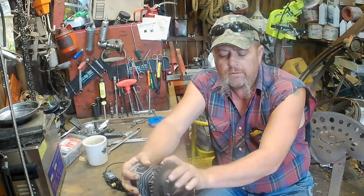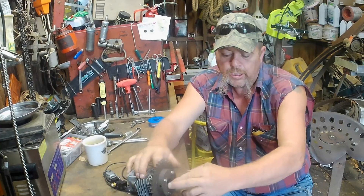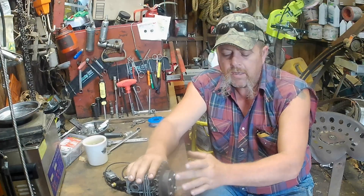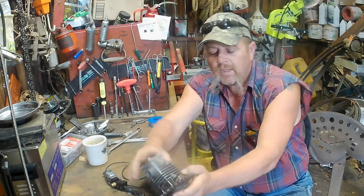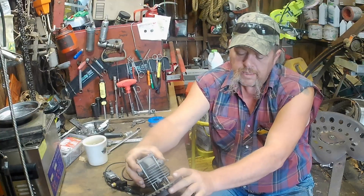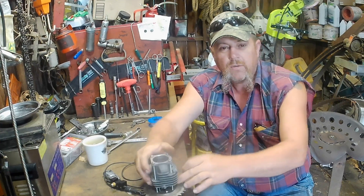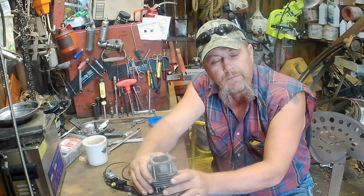It's a fixed bore cylinder - this is just a finished bore cylinder. They're parallel between here and there, which is nice. Then on my three jaw chuck, those mini lathes are small enough it'll actually clamp inside that one inch bore. So this is parallel to this. When I mash this up against the face of the next step in the jaws, it gets this pretty parallel, which is important on this side. But I'm not turning this, I'm turning this.